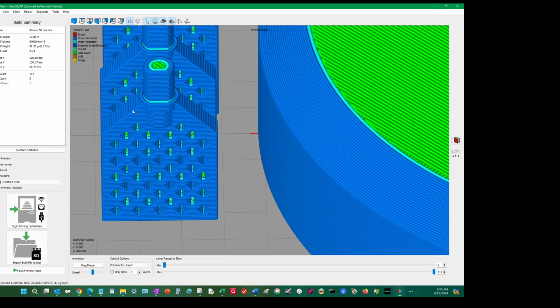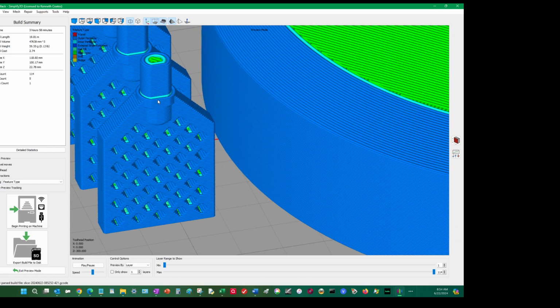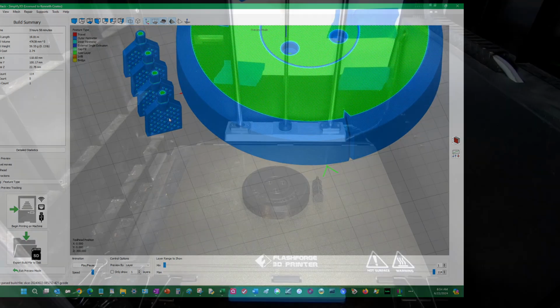This is not that complicated of a model here. I could do this myself. And I printed it in 2 parts. There'd be a socket up here. I could print this as an axle that embeds in this socket and glues into this socket here. And then I could print this horizontally, and it would be a lot stronger because the layer lines would go in this direction instead of this direction. So then if you bend it, it's not going to break. But I think this will be fine.